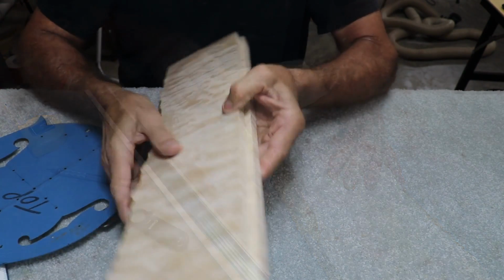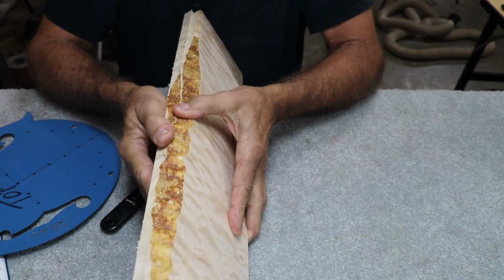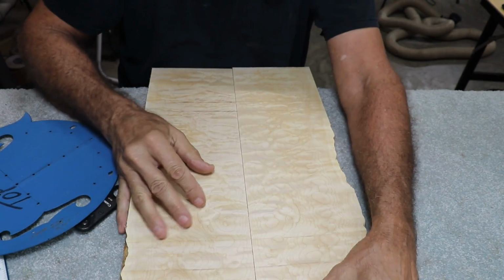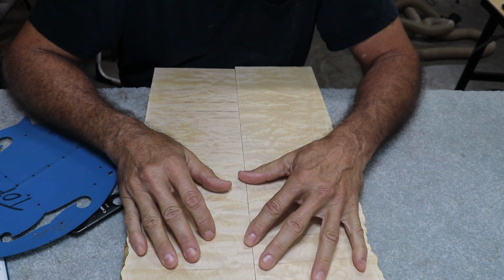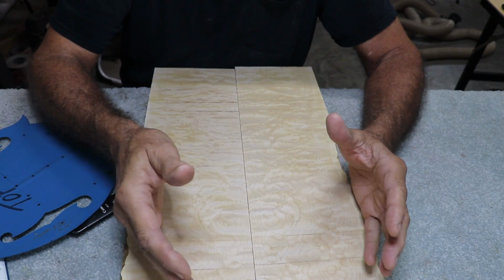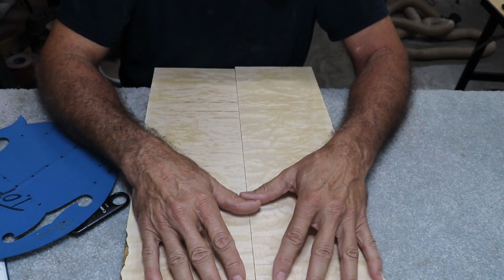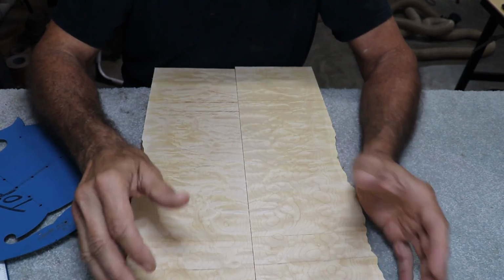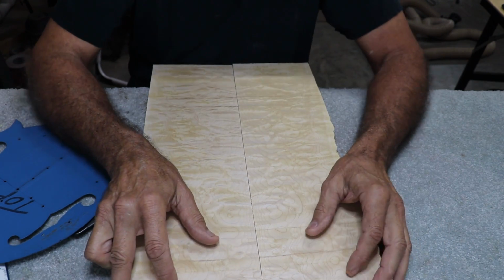and make that straight cut. Well, I've sliced that edge off now, and so, you know, these pieces were together in the tree like this. You open them up, and now these two pieces are basically book matched. As I mentioned when I was getting ready to saw some of this, they're relatively book matched, but on slab sawn wood, it won't stay totally book matched. As you carve down, the grain will change more because it's not quarter sawn. But that's just part of it. I can't help that. It's the way the board was sawn, so I can't change that.